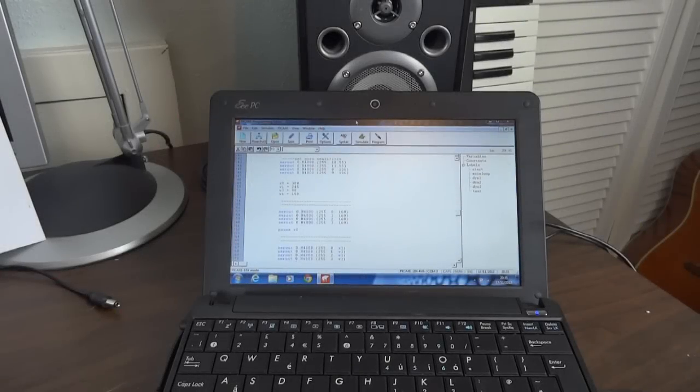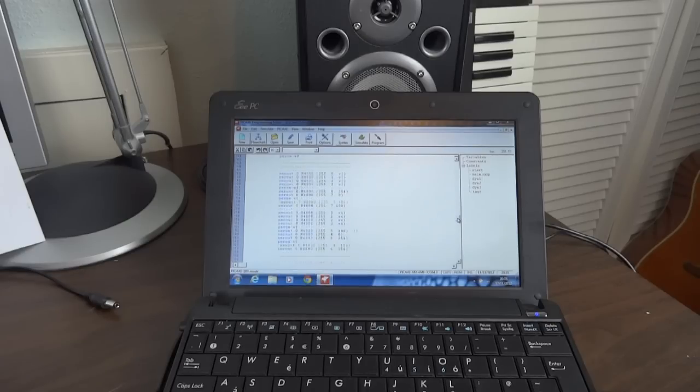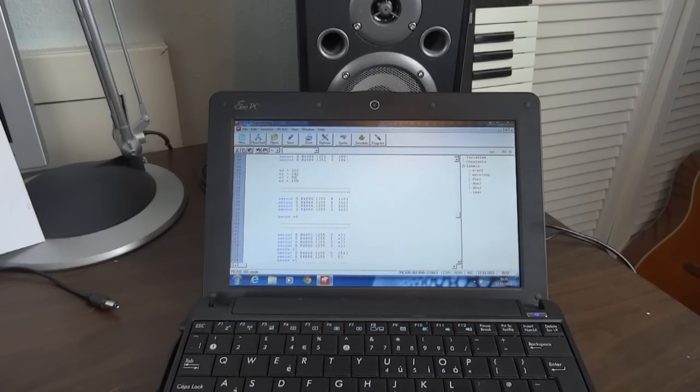So I've got my PICAXE programming editor here. The code is literally, as I said, loads and loads of timers and fixed positions in long sequences that basically make the servos move, and then the gyros compensate for that movement. So I've used as many variables as I can and as many loops, but essentially it means I sit here for ages tinkering with the numbers. You know, of leaning to one side to the other, the time that it takes in milliseconds, and even 1 or 2 milliseconds will upset the gait. That's the way it walks. And also the gyro sensitivities, which we set here on a servo channel. So even 2% will make a difference to the way it walks.